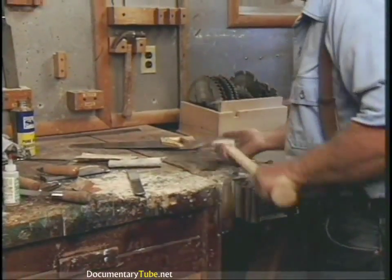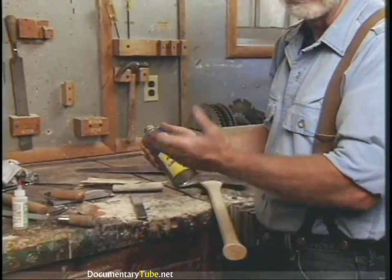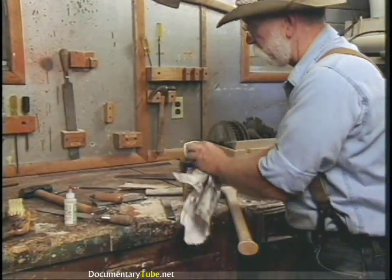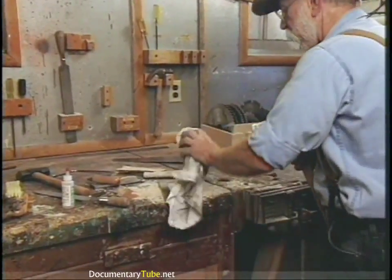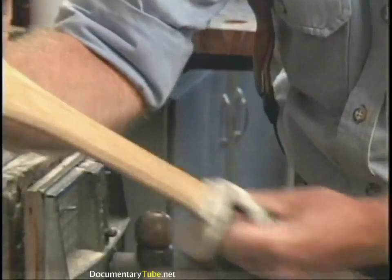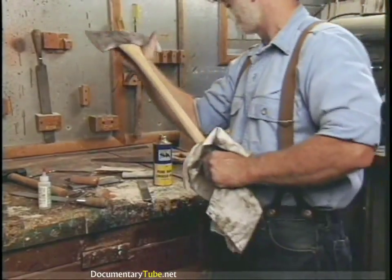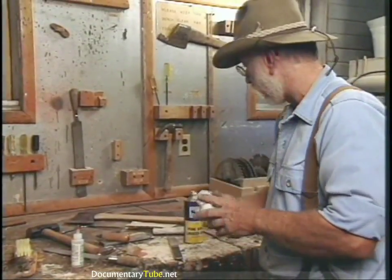After I've sanded it down for purchase so you can get a good grip on the butt, I like to take and rough it up with the rasp or the four-in-hand — just run it across the grain like that. And the last step is to oil it with linseed oil. This is pure raw linseed oil; you can use boiled linseed oil, it works just as well. Take a rag, put a little bit on it, put it on the butt, rub it on the top real good, and then rub the oil into the handle real good. After you finish, wipe the excess off. Be sure to throw your oily rag away — spontaneous combustion with oily rags is absolutely a hazard. I've seen them burst into flames before.